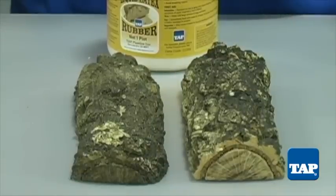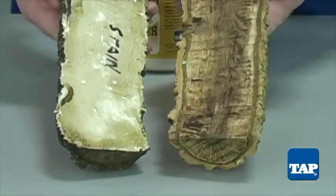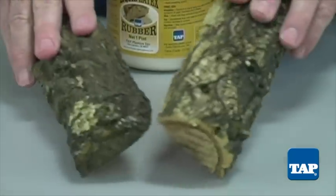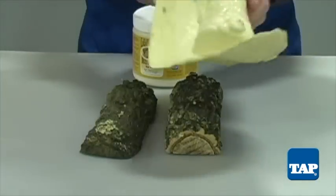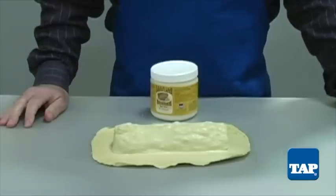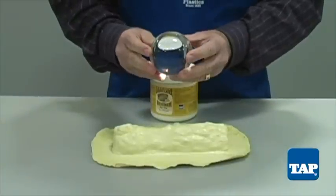One of these is the original piece of wood, and the other is a casting from the latex mold — note the intricate detail that latex can pick up from the original and transfer to the cast part. Mold release might have obscured some of this detail. Finally, latex can only be used on mold shapes that allow the mold to be peeled off like a glove, so latex would not work on a part shaped like this.